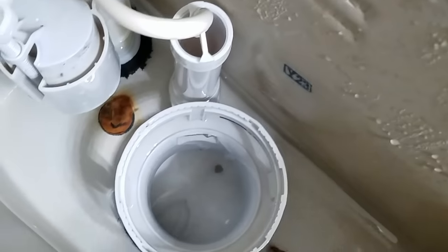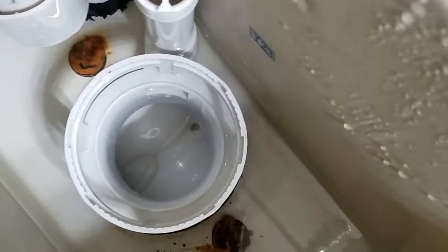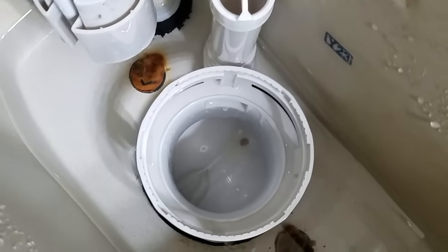You should be able to see all the way down to your bowl right here. If you've got something obstructing it, you may see it right through there. The residual water is going down and the water is supposed to shoot through here. You'll get some through the top around the bowl, but most of it comes right here — that's where you get all the water that swishes through. If you've got obstructions, calcium build-ups and such, that's a problem with the flow.